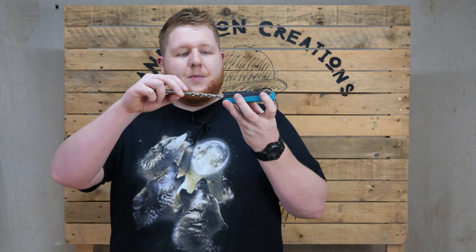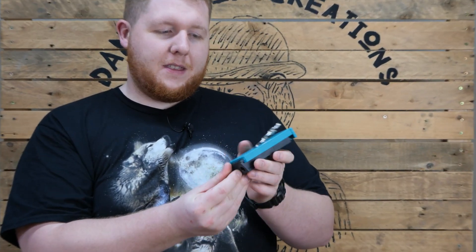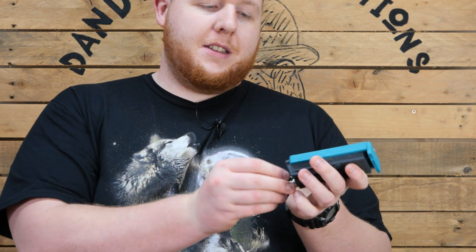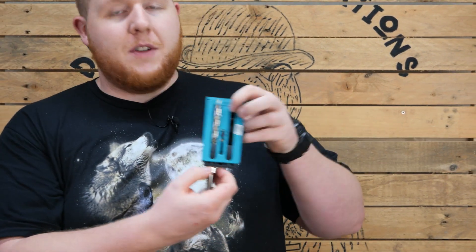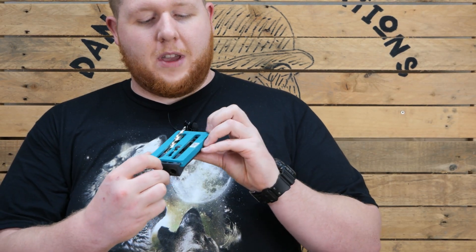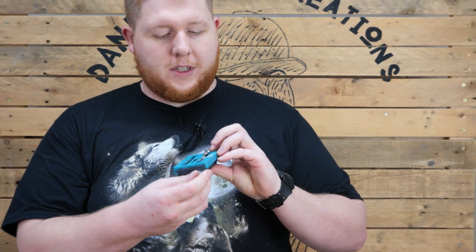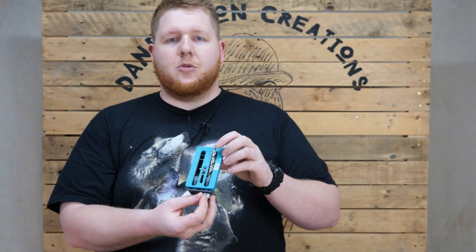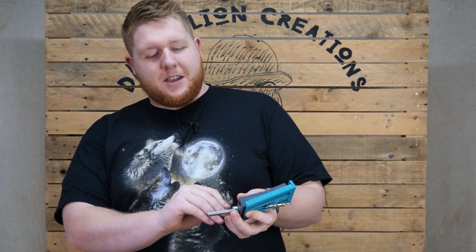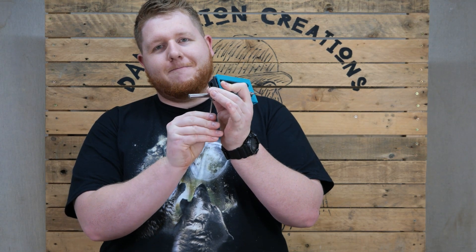Get your drill bit, place it in the hole. Get your drill stop that comes in the pack, put that in. You've even got a little diagram there showing you how to use it. Put the flat in line with the 19mm measurement, drill stop on, get your key — you'll need to grow another five hands — and voila, ready to go.